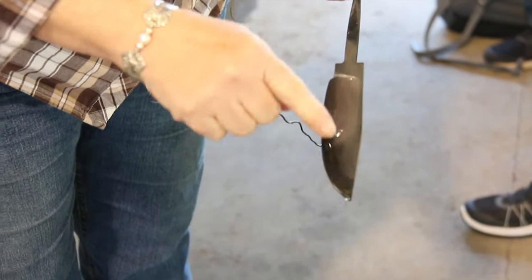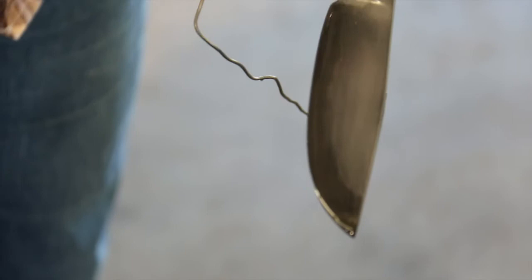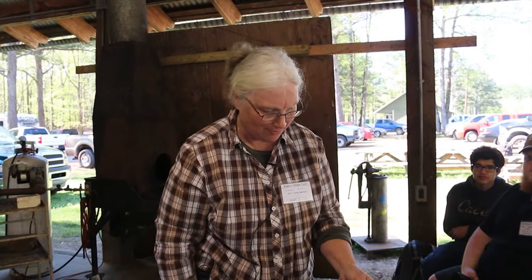How did you do the heat treat? I take Satanite and clay the back. Okay, and we've got big heavy pots, and we'll take it up to 1380, and then it'll sit in there for about 10 minutes or so, and then it just ramps down. It takes all day to do this. No, that's not true. I'm talking about the annealing. I'm sorry, I'm confused with that one.